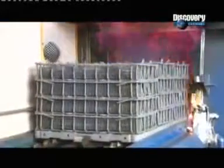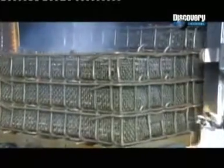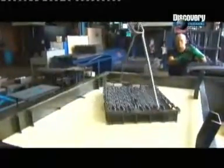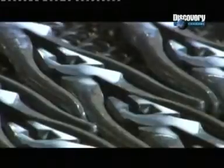Next, the cutting pliers go into a gas oven for another 2 hours of heat treating, a process called martempering. When they come out, they cool in an oil solution, rather than the salt solution that cools the gripping pliers. Steel is a finicky material, so it's critical to manage the heat treating process meticulously, otherwise the metal will be substandard. After heat treating, the pliers go for a bath in a vat of rust inhibitor that helps protect the steel from corrosion and lubricates the riveted joints.